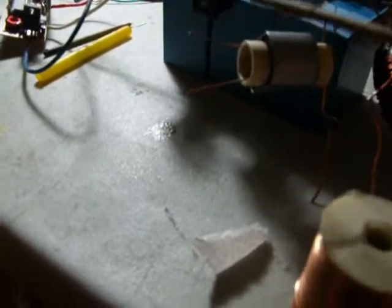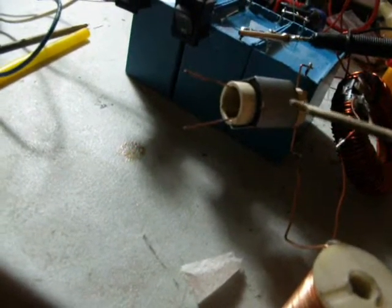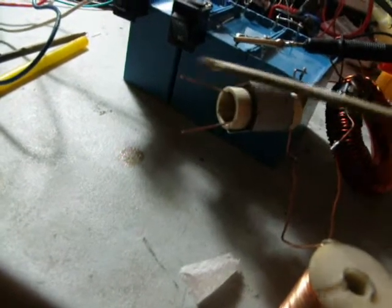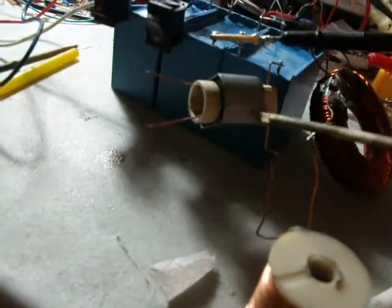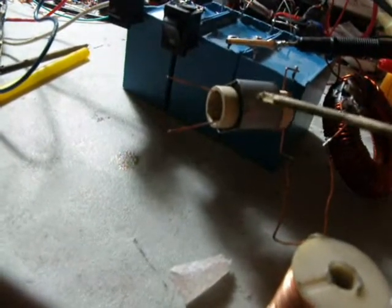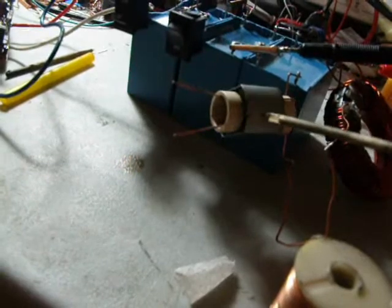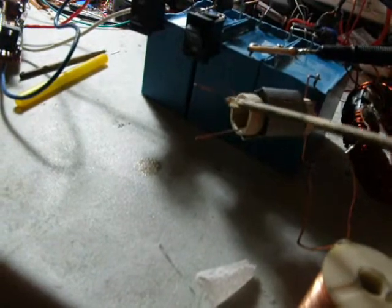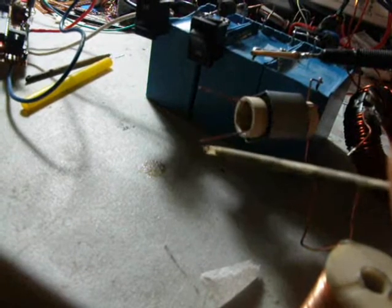So I'll just describe what I see with my own eyes. The discharge actually happens and starts from here — that's what I know, because here's the minimal space between electrodes. One goes like here and another one like that, so it's like a triangle. The discharge starts here, and then the arc between those electrodes, being pushed by a magnetic field, propels up here. So another arc happens, and around these electrodes I see the shining up to the ends. That's what I actually see.